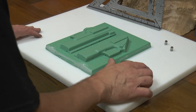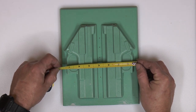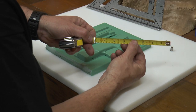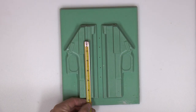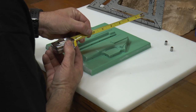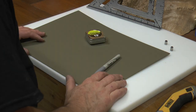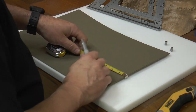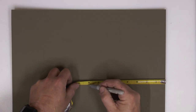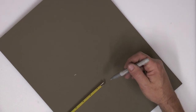The first thing we've done here is we've taken our two halves of our butterfly split and we've put them onto the base plate. Now we're just going to measure across so that we can determine how much kydex we need in order to be able to vacuum form this. And then we're just going to cut out what we need.